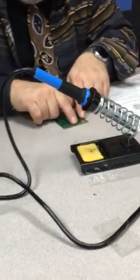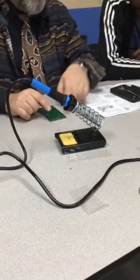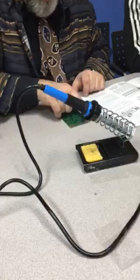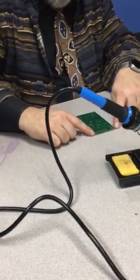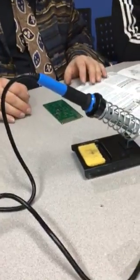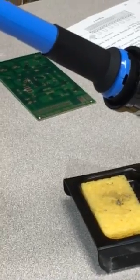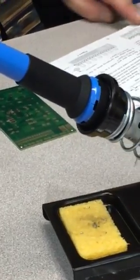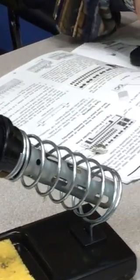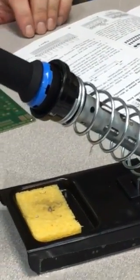I went from this side, now I'll do one in the middle, then over here — just trying to jump around as much as you can. You're going to do steps one, two, and three for all of these pads going across, just like the examples shown. This teaches you how to control the flow and do the process of soldering. When you're done, check off each step so I can see exactly where you're at in the procedure.